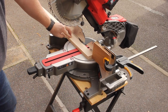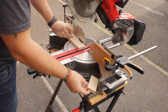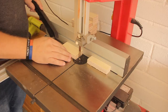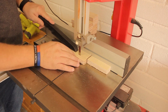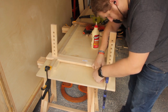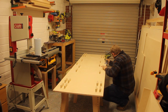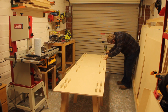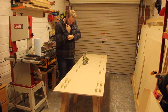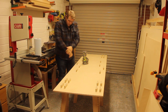The next point is to make sure it doesn't slide around, so I cut two and a half inches of plywood to use as a brace underneath. I cut them to just under an inch on the bandsaw because they were too wide, then glued and nailed them into place so I know they're in the right position and everything would be nice and sturdy underneath. I then went around underneath with a slightly less aggressive chamfer just so it would look nice and not hurt any of the kids. Sawdust gets everywhere — but after that I thought I'd join in with Sean in the Sheds' workshop dance, though mine's not as good as his.